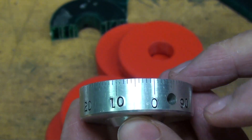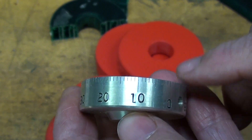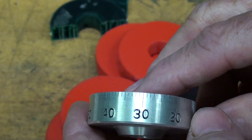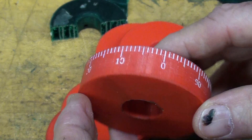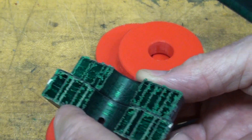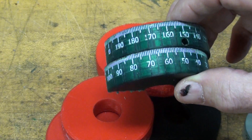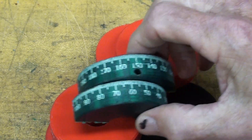The reason I started this project is that it's very difficult to make one of these out of metal and to stamp the graduations accurately so they look nice. Even on this one you can see it's rather uneven, even though I made a jig — it's difficult to stamp on something round. That's when I decided to use 3D printed dials for the Atlas lathe instead of aluminum. Take a look at the inside — I cut one in half and you can see the fill: it's only about 20%, which is all we need for this application. Thanks again to Kevin; in the following clip I'll show the Thingiverse link.